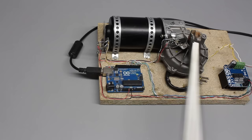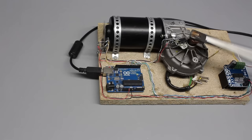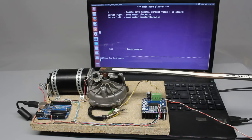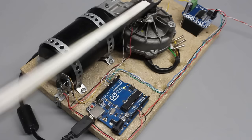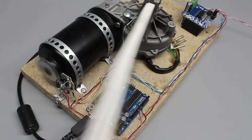You get a very powerful and precise digital servo. To get the maximum speed and torque you have to adapt some software parameters of the control loop in the source code of the Arduino. Besides the proportional controller, a soft start function is implemented to avoid current peaks whenever the servo starts spinning. The setpoint of the servo is commanded through the USB interface, and the software on the host computer runs in a Linux terminal. That's all about rotational encoders — you can find the schematics and machines using the drives shown in this video on the project page. Thanks for watching!